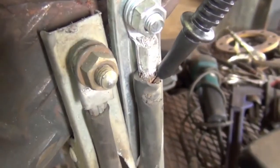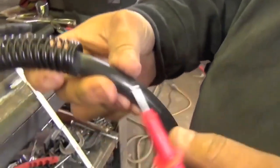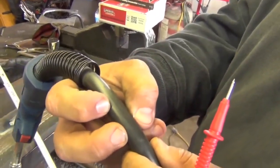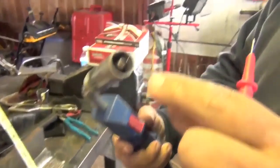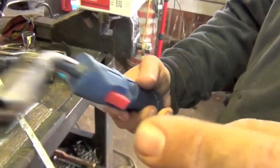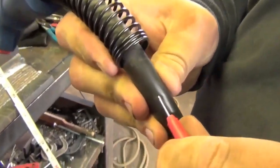And the positive we can put inside the gun lead. The gun lead has in the middle the liner where the steel wire goes through. On the outside, there's copper braided wire that transports the current to the contact tip in front, which puts the current into the wire. So the best thing is to go right to the copper on the outside.